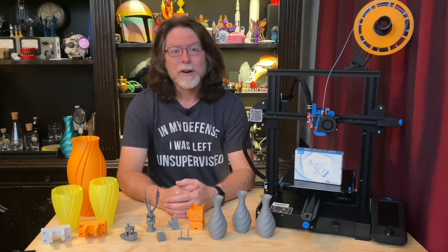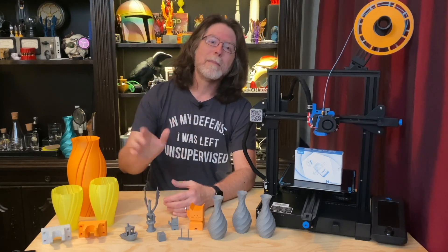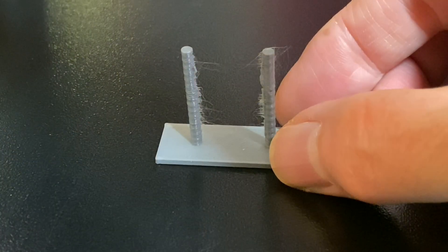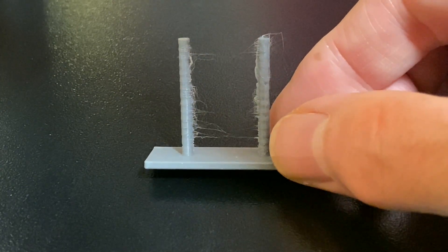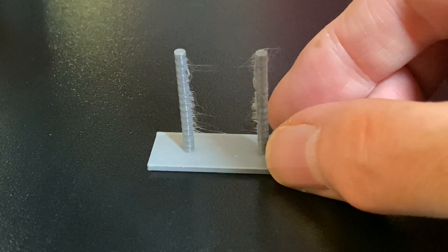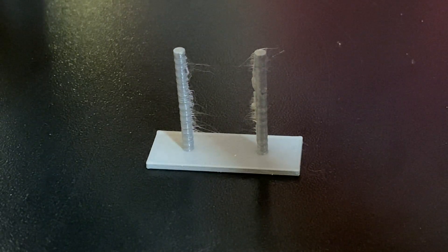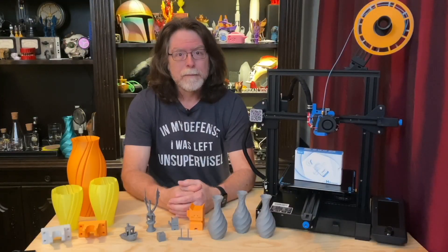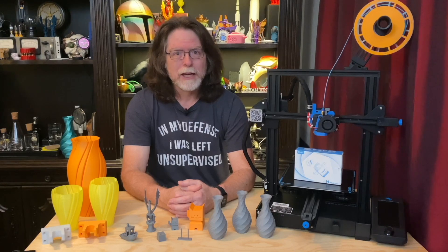Speaking from experience, this can make it hard to get your print settings dialed in for the H2. I made a rookie mistake when I first installed it and completely forgot to run Marlin firmware's PID autotune so the printer could accurately control the nozzle temperature. I was having a hard time getting the stringing under control and was noticing weird issues on the retraction test models — temperature swings of close to 10 degrees Celsius, and the little towers on the retraction tests had a very regular ridged look because the filament's appearance varies with printing temperature. But once I ran the PID autotune, the printer was able to keep the nozzle locked in at my set printing temperature and I was able to get the retraction dialed in. I've got a video linked in the description to show you how to run Marlin's PID autotune on the Ender 3 V2.